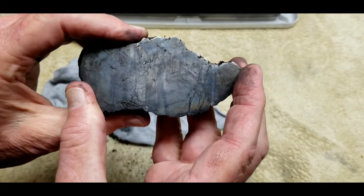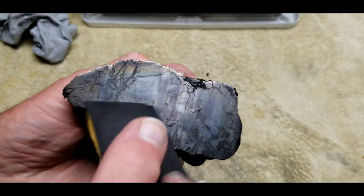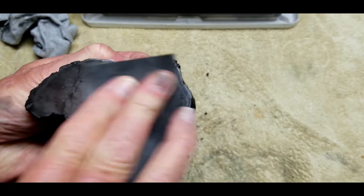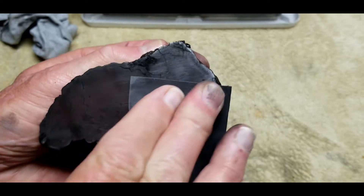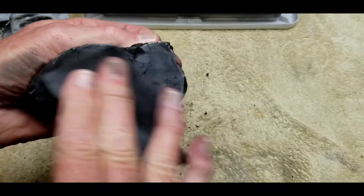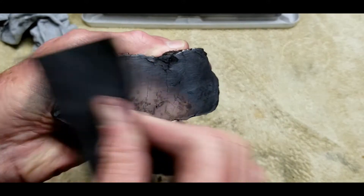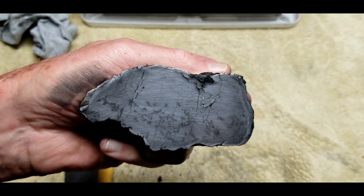It's just a surface tarnish. Let's get some 800 grit sandpaper and take a quick look at it. I don't see any rust. All that tarnish is coming off pretty easily — that should be pretty easy to remove. I do want to get off all these flaking pieces; I'll probably take a wire brush to it to get rid of all that flakiness. That's coming off pretty good. Next step is an alcohol bath overnight.